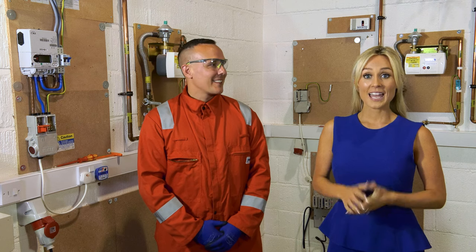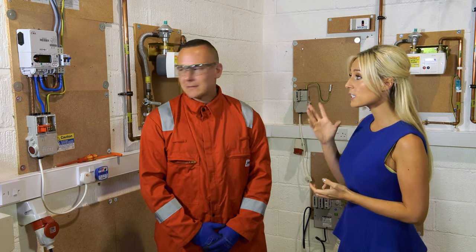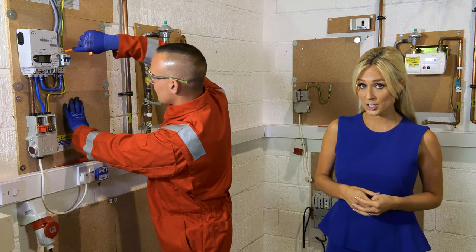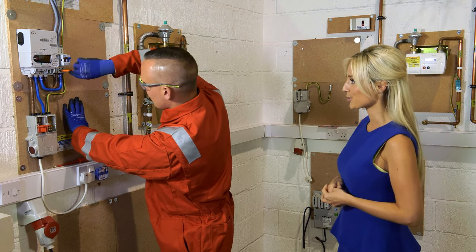If load tails are in poor condition, damaged or undersized, install isolator as per code of practice and leave fault card TOE8. Now you have fitted the meter and the cables are in place, using insulated tools, ensure that all terminals are checked for tightness. Loose connections can cause fires. Check the meter, isolator, outgoing side of the cutout, neutral block, and other associated equipment terminals.